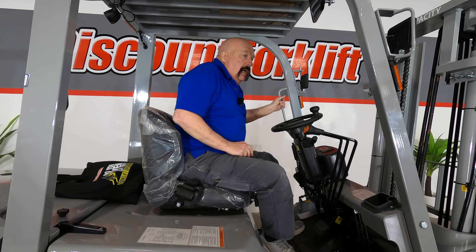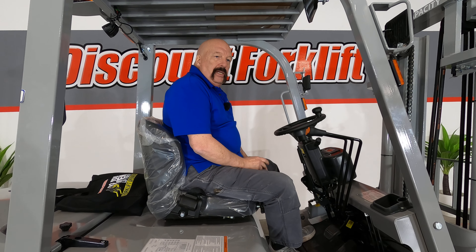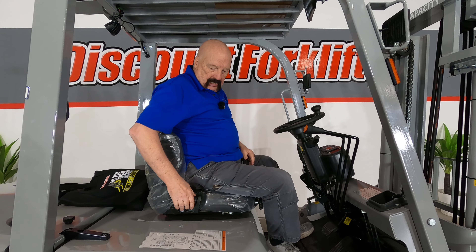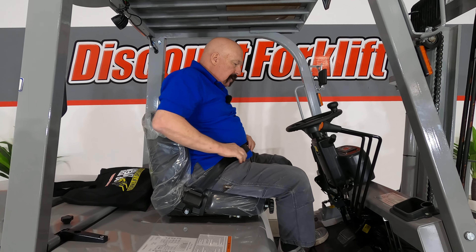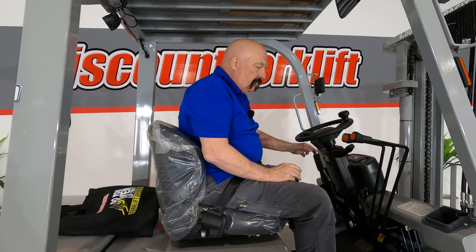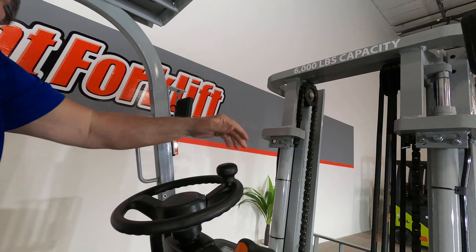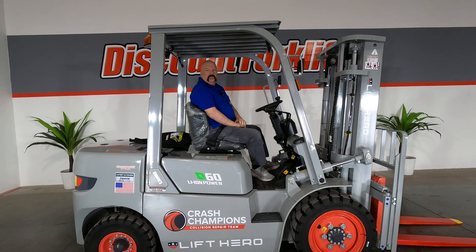In the name of safety, there are a number of built-in safety features. Four things you need to be aware of before you can operate the forklift. Number one: you have to have a butt in the seat — there's an operator present system. You can't start or operate it while standing outside. Number two: the seat belt — common sense says keep it fastened at all times. Number three: your transmission has to be in neutral. Number four: your parking brake has to be on. If those four things are not done, you cannot start the forklift. Don't overload the forklift — it's rated at 6,000 pounds capacity.